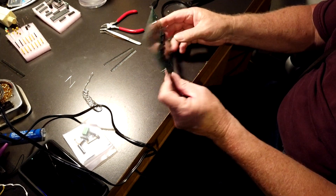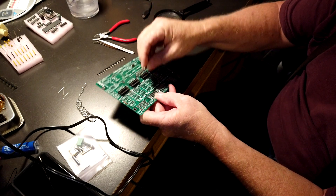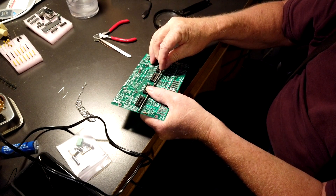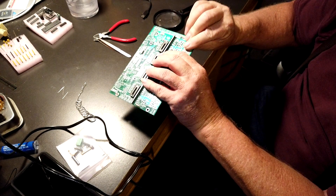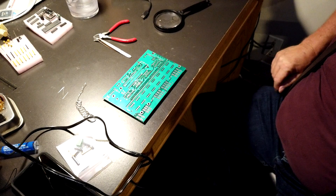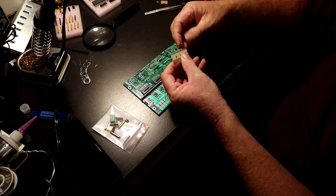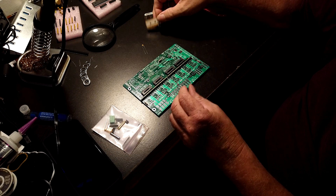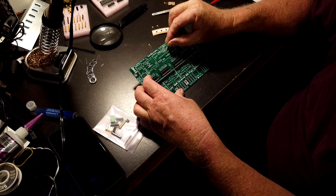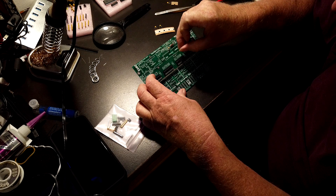Those four are all soldered on. Now you've got these two 32-pin sockets — they go in right underneath those, right there. Those are soldered. The next two are these capacitors on this little cardboard strip. You need two of those — they go in right above where it says IC3. C6 is right above it, just drop them in, and C7 is right below it. Turn it over and solder them in.